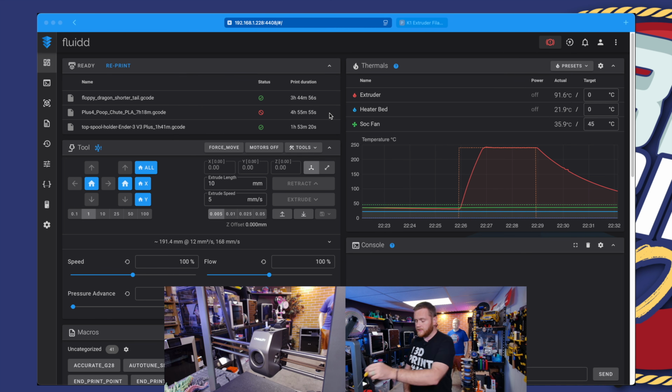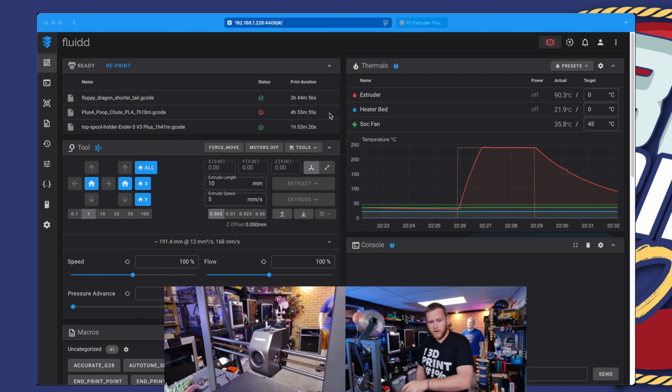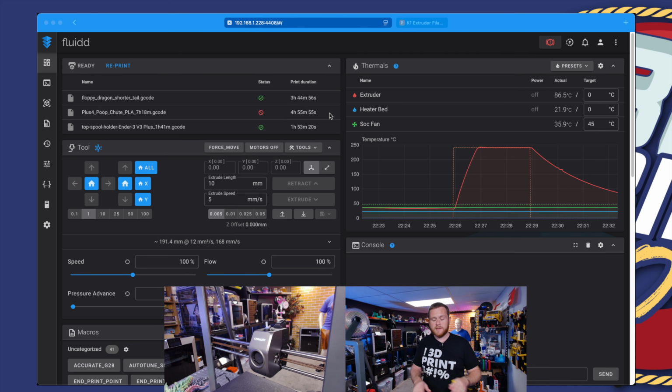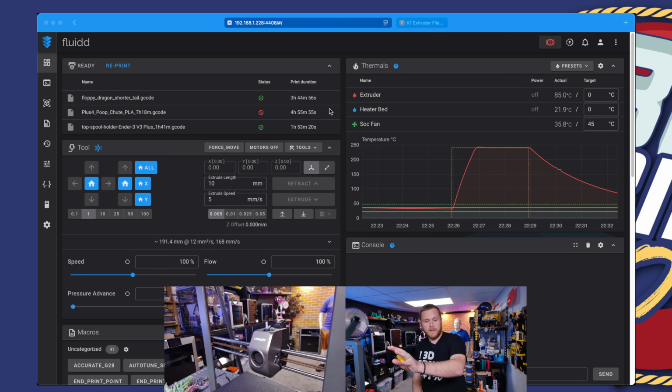And the way to do that is to go into the settings of the printer, type in root access or find root access on there, tap it, and then go down. It's going to wait for 30 seconds. You're going to hit OK and the little check mark, and then you will get root access. You don't have to do anything else, but now you should have access to the Fluidd front end if it doesn't already come up. All right, so that should be easy.